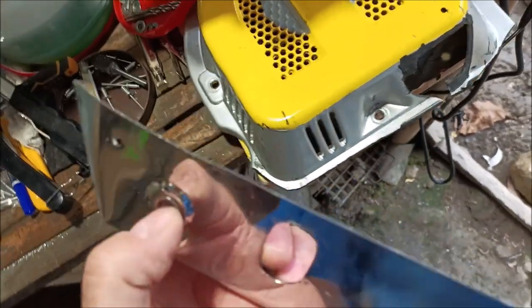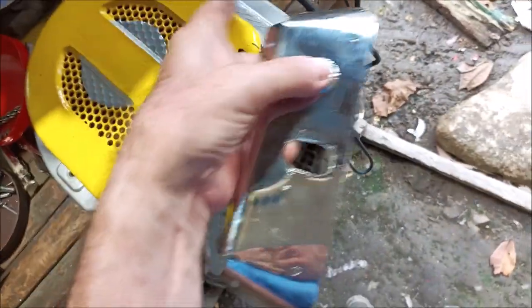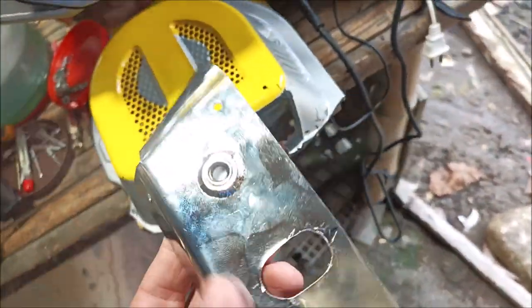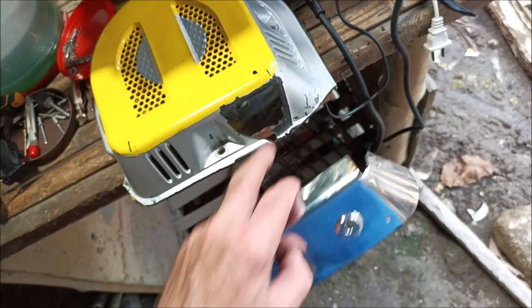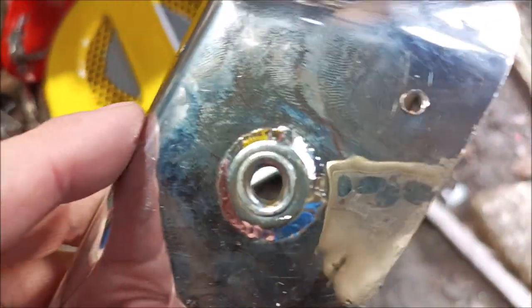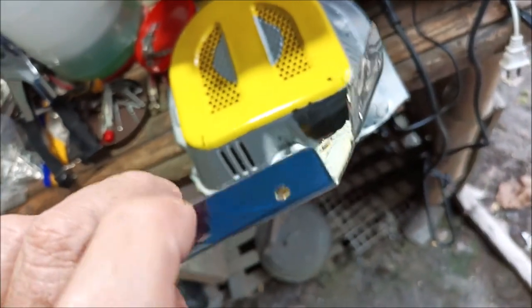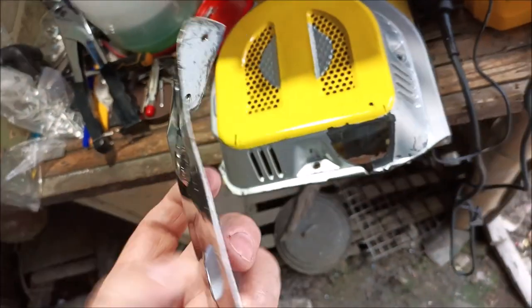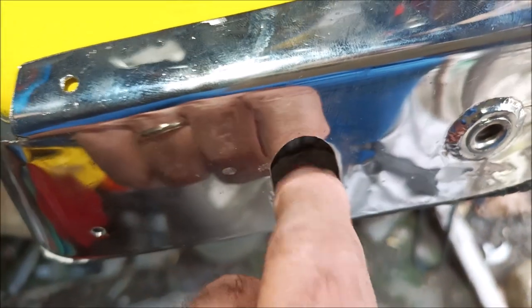When it kicks back, it could dent the stainless, rip the rope, or crack more of this housing — I have no idea what it's going to do. But at least stainless steel is stronger. I also welded the grommet for the rope because the guide grommet is smooth so it doesn't cut the rope — if you just put the rope through the raw 0.5mm stainless edge it would eventually cut right through. I also put a service hole in here to get that bolt in place.